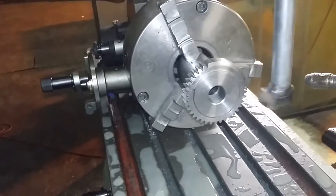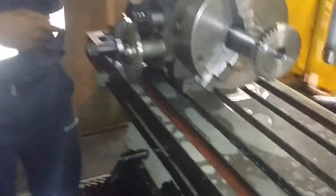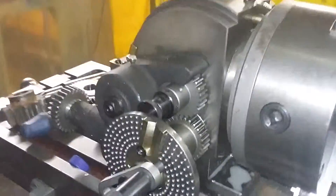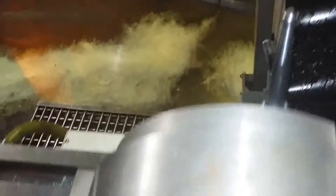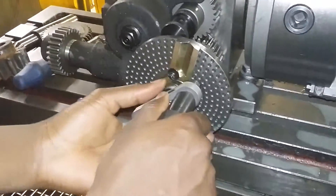As you can see, our flying cutter is already rotating. It's time to change to the next gear that we have to cut. I am going to loosen here at the back. I have loosened. Then I am going to move — this is 37, so I am going to move 1, 10 and 3 holes.